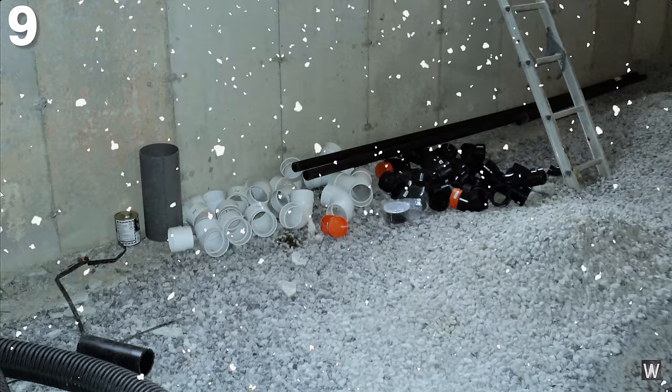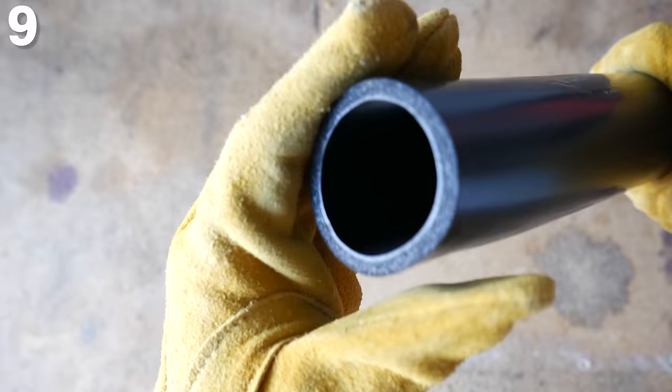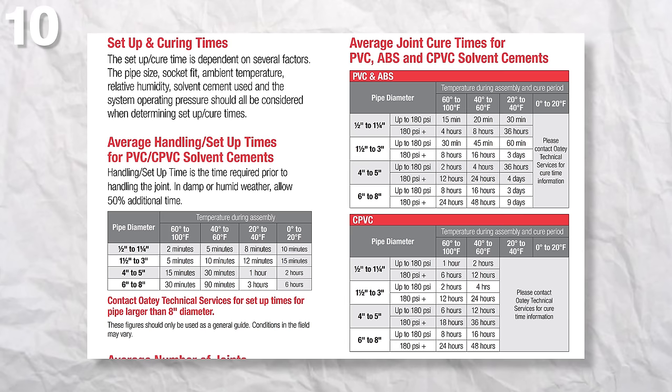Number 9 is leaving these pipes in the hot or cold. All plastic pipes become brittle when exposed to cold, and when they've been in the heat, they buckle and bend. So if you can, store them inside at all times.